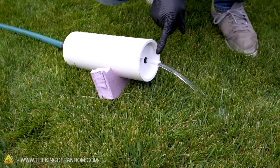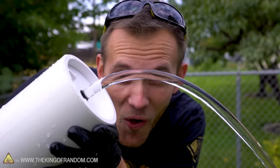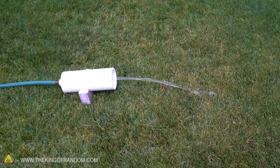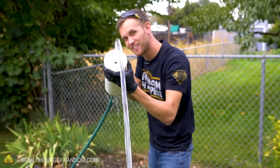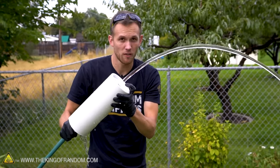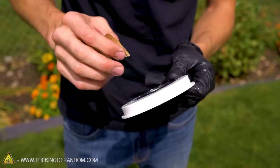You can already see this is working pretty well. Look at this — it's just a nice clear jet, you can easily see right through it. I'm going to try turning up the pressure just a little bit. At higher pressure, it's still going pretty well, but there is a little bit of waviness right as it's coming out of the nozzle. So I'm going to turn off the water and sand down the nozzle just a little bit with some high grit sandpaper to smooth it out just a tiny bit more.